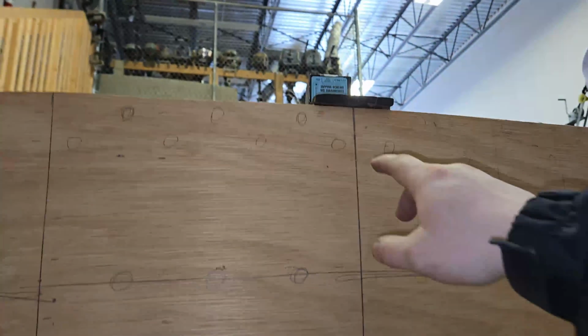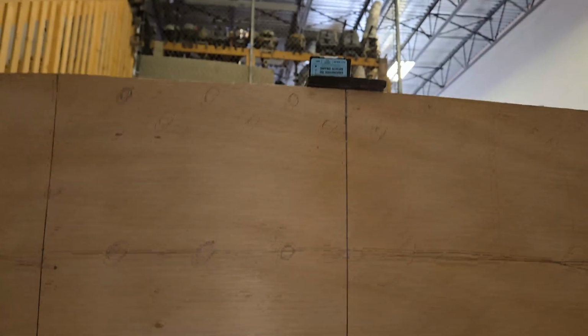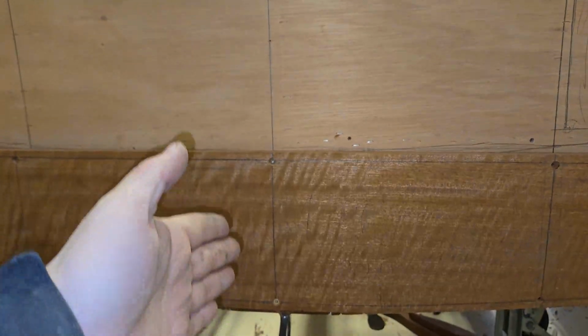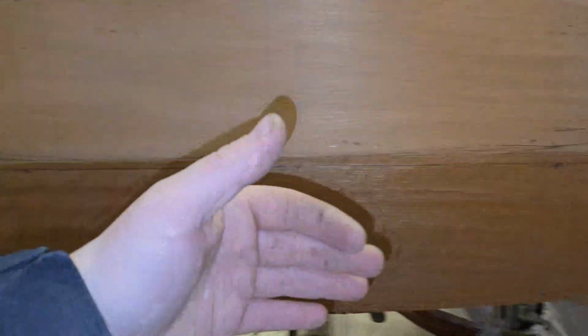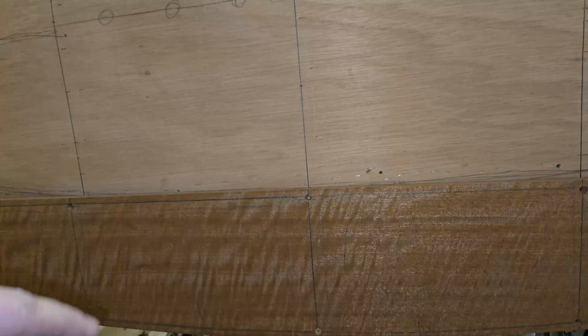But for the actual structural part, like the frame for example, where it's a lot thicker, we're actually going to be using 8 by 1 1/4 for those to get a little bit more grip, because we can be a little bit more confident that the wood isn't going to shatter once we put a fastener into it. But here you can see I have the plank lined up right in the exact middle, so I can begin to push it and adhere it onto the back of this and start dry fitting the next plank.